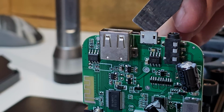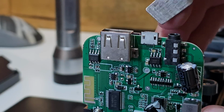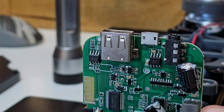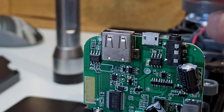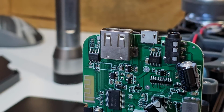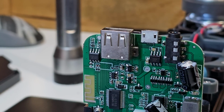So the actual body of this isn't moving, but the pin inside the socket is free floating around, and it's only in certain circumstances that you can actually get it to charge. So the option we have is maybe replace this altogether with just a couple of wires, and put a socket externally, or we find something else that's got one of these sockets and we swap that out. Well, think about it, and I've got a heat gun. I can heat gun this off.